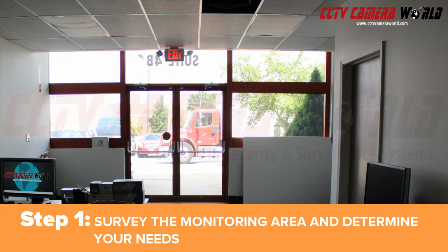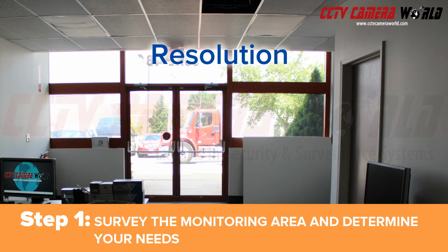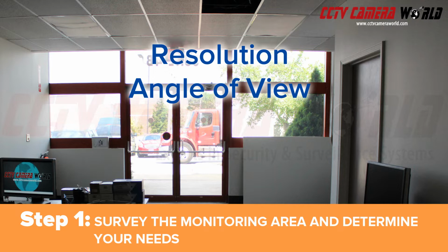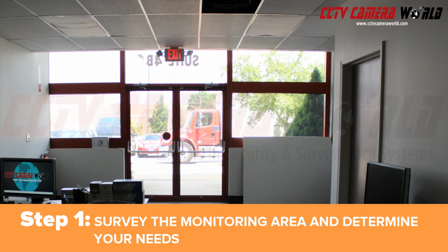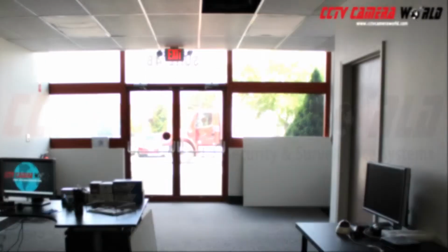Always start off by surveying the locations that you want cameras to monitor. How far away will you need facial detail? What angle of view will you need for full coverage? How many feet of night vision will you need? What aesthetics do you prefer, bullet or dome? After you know these things, you can feel more comfortable about your camera decision.